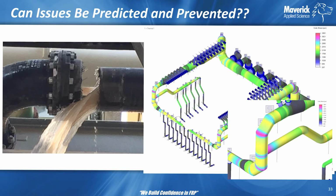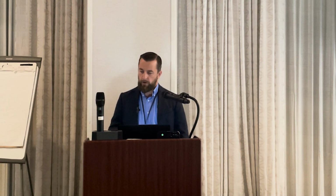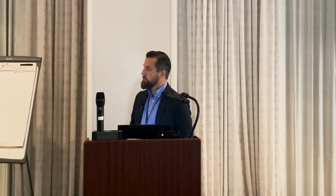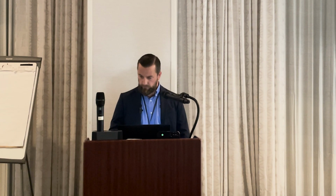So can issues be predicted? In the sense of knowing where hotspots are in the system, yes, do stress analysis. A well-done pipe stress analysis is going to tell you where the hotspots are. If at all possible, can you move joints around in your system, whether it's a field joint or where your flanges are, to get away from the hotspots? Sometimes you can't. If you're at a tee or an elbow, I get that. But maybe a hot spot on an elbow is not a good place for a socket adhesive joint, or maybe that's a place you want to overwrap that socket adhesive joint. Those are the different considerations you gain by doing a pipe stress analysis.